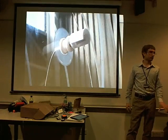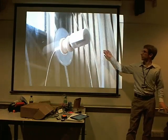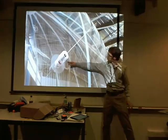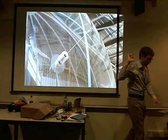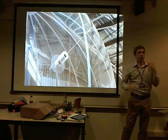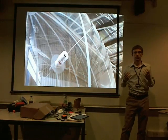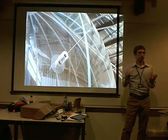Here's a close-up of a modern French balloon, still evolved from that same design with the nacelle down the center. This is a temperature sensor sticking out the side — you can see the skirt that's bonded, the wire going inside the payload, and a little shield. Getting precise temperature readings up there is very difficult. Amateur balloons don't really bother with this, but your temperature sensors are likely not giving you the real air temperature — they're likely skewed anywhere from a degree to 10 or 20 by infrared from the sun. There's not much air density up there.